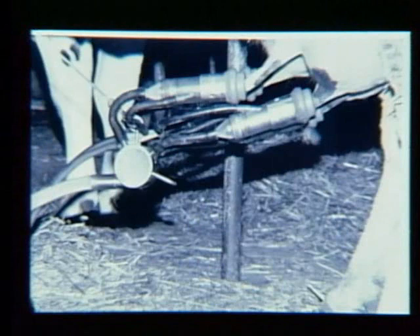Take a look at this picture for just a second. I don't remember where we found it, but let's just say it was some 15 or 18 years ago in some dairy magazine here in the United States. This is how one of the big milking machine companies at the time introduced their rope unit to the market. They ran this picture to prove that that rope-type takeoff could indeed milk automatically and remove the teat cups from the udder. And would you believe, nobody at that company noticed what was happening? Look at how those teats are stretched from the residual vacuum. Fascinating, isn't it?